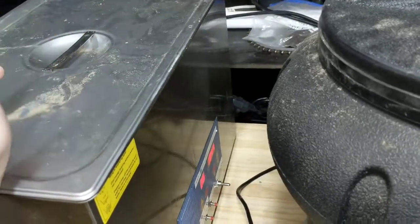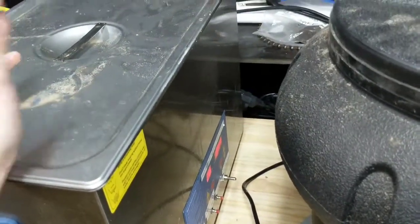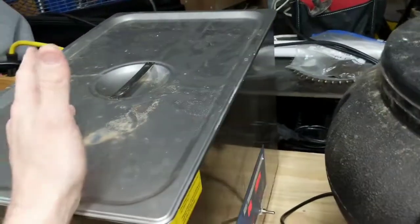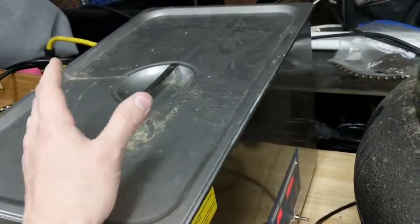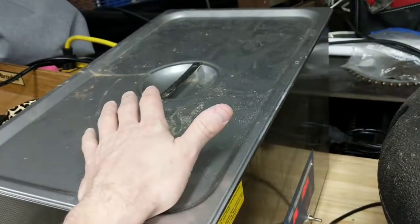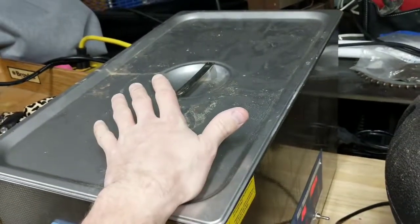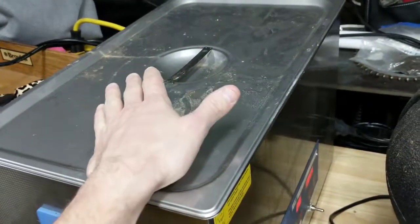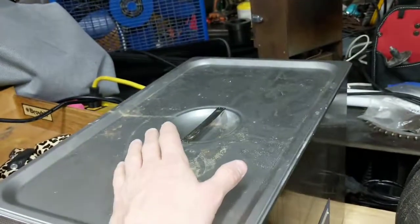But it works like a charm. You crank the heat up and it will eat the paint right off of stuff with the ultrasonics. Maybe the heat, maybe it's the Simple Green. Don't know, don't care, works fine. Don't use the green Simple Green. It works great too, but it corrodes aluminum. So you'll get everything clean, but your aluminum will be a nice dark gray.